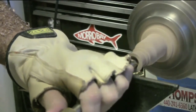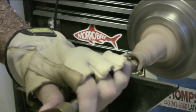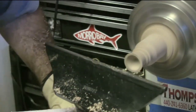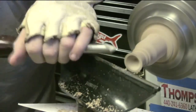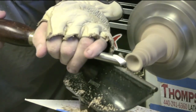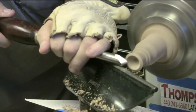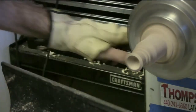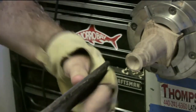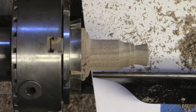There's a little bit of movement so I'm cutting that out. That's as thin as I want to go with that. Making sure the inside is nice. I'm going to move my tool rest a bit closer and give it a slight chamfer using a scraping cut, going back and forth. Now I'll turn the tool rest back around so I can get overhead.